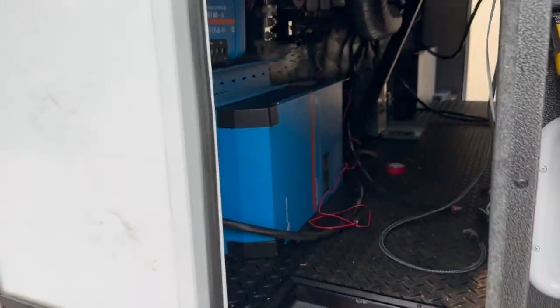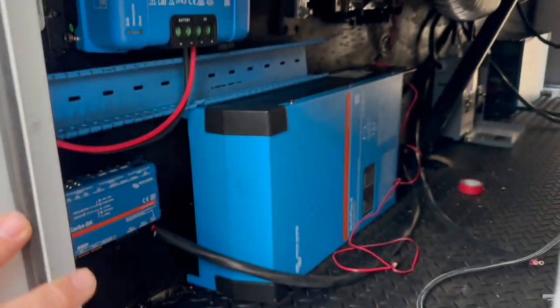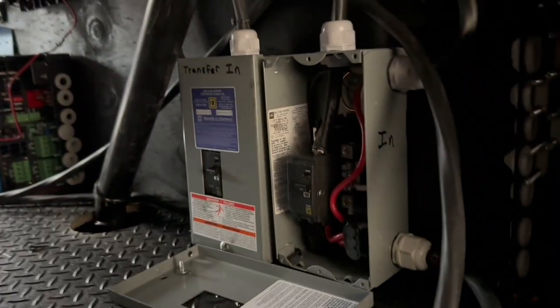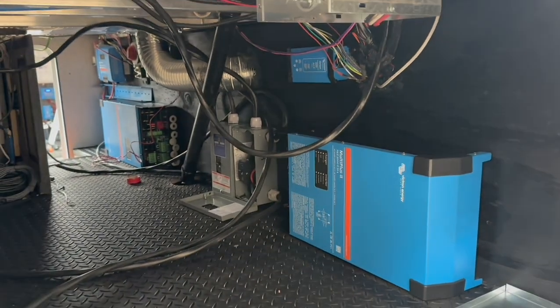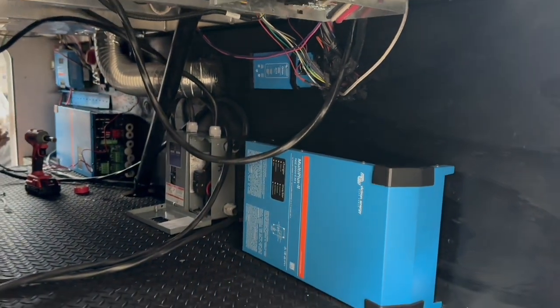At the beginning of the next day — we've got a lot of stuff in. The wire chase isn't mounted yet but we had it in there for sizing purposes. Going to get the battery tray cut and put in so we get our batteries mounted and start building that up. We've got our two breaker boxes ready to go for how we're going to split between our two inverters. It's a 24-volt install, but we're going in parallel with these two so we can get up to about 4800 watts when he's off-grid. We're going to get those wired in first, measure all our other lines, get everything wired up, and then do something cool to cover these — without causing him any loss of space.